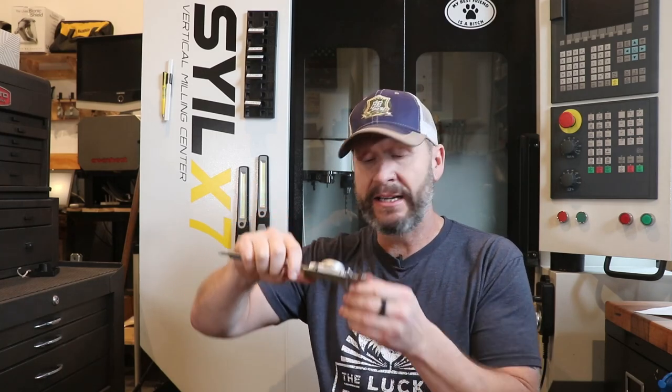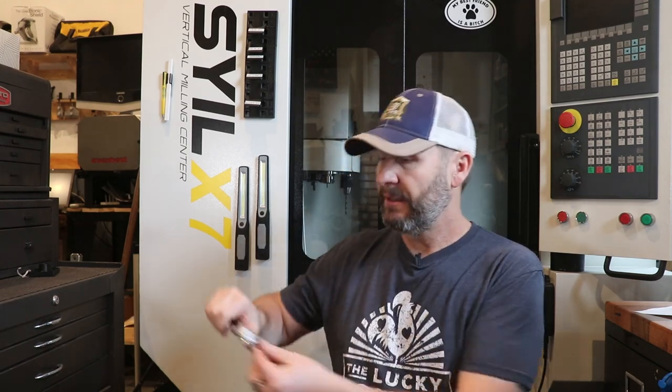If you've made it this far and you're an advanced machinist, I don't know why you're here — this is super simple stuff. We're going to start with the scale: this is a six-inch scale, so about 150 millimeters. Next, dial calipers. These are very good for making outside measurements. You can do inside measurements to some degree, and depth measurements for an approximate depth. I love the dial gauge — I seem to trust it a little bit more than the digital. I also have a pair of digital, but these repeat back to zero when you field-check them and they're easily calibrated.